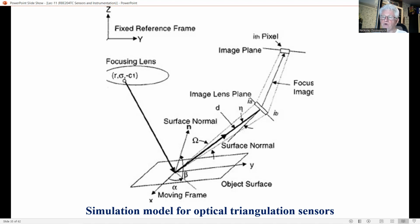By cycling along the ring, a set of chords is obtained approximating the shape of the object, actually only in the cross-section with the plane of the ring. When the object moves through the ring, just by following, a 3D image of the total shape is obtained. The method is cheap and simple and appears to be suitable for characterizing the shape of potatoes and similar products.